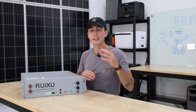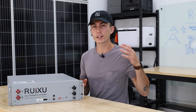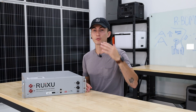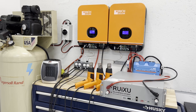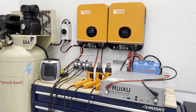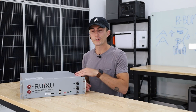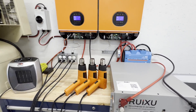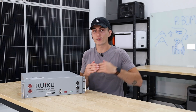Most importantly, we wanted to start by testing the R-Bomb. This battery has an interesting surge rating — it says it can do 101 to 119 amps for up to five minutes. We put it at 117 amps just underneath that limit, and it actually ran for just over four minutes — four minutes and 15-ish seconds — which is pretty impressive. The second rating is 120 to 149 amps for 15 seconds. We ran it at 140 amps and it lasted about five seconds. Overall, not bad, but it never hit what it was rated for, though we also didn't do it at the entry level numbers.